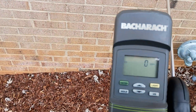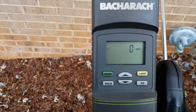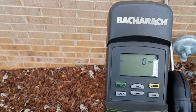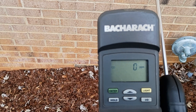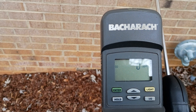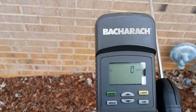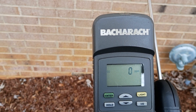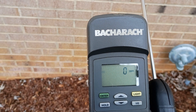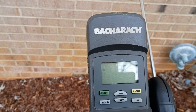When I come to these systems, I'll usually record what my reading out here in the pipe is, so it can be monitored over the years. If it ever changes and you see a big spike, you know something's going on. I don't really need a big combustion analyzer — I just want to sample carbon monoxide. It's just like when you pull up behind a car at a red light and it's choking you to death. That vehicle is putting off huge, tremendous, lethal amounts of carbon monoxide.